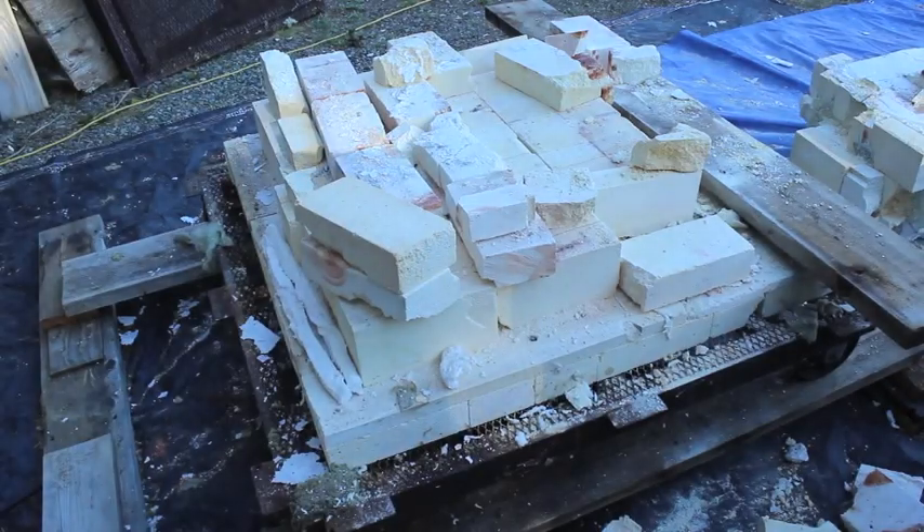I can start the rebuild right away from this position. I don't need to take anything else off the furnace frame. I've got my bottom course of bricks and an inch of fibre board, and then the first course of K23s stood on their edges, so they're 4.5 inches high. I'll clean off the rubble and blow off the dust and start the rebuild right from here.